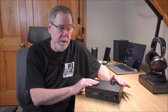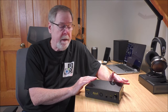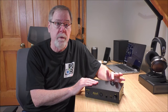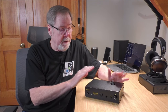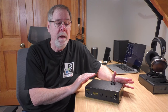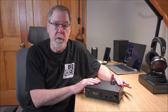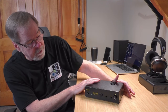It uses his 2590 discrete op-amps and his discrete voltage regulators. It has zero global feedback and no capacitors in the signal path, which is very unique — especially on a unit that uses a tube buffer. It does have a tube heater soft start with a 40-second delay. The frequency response is 10 Hz to 100,000 Hz, it's a full 2 watts at 32 ohms and 750 milliwatts at 300 ohms, and it has a very, very high damping factor.